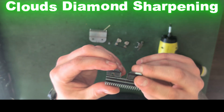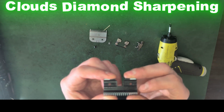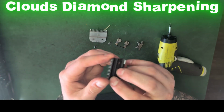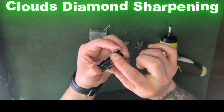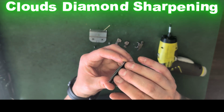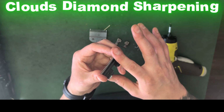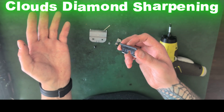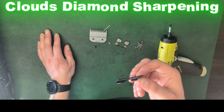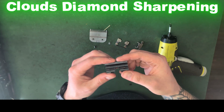So this cutter blade, this one's ceramic. We sharpen ceramics because we use harder than ceramic material, which is diamond. We can sharpen metal ones, and what we do is we carve the inside out here very lightly, like so much you can't even see, but it's there. And then when that shape goes flat or goes away and the whole blade becomes flat, like if you sharpened on a block, well, it's going to go dull very soon. So if you use a block, yes, a block will get you through the cut, but it's not going to work for very long at all.